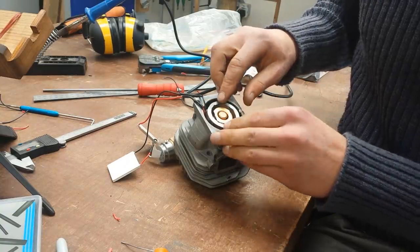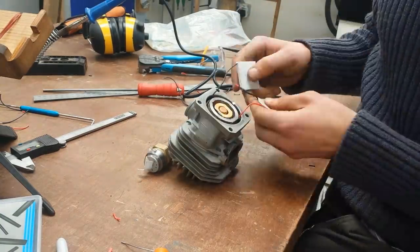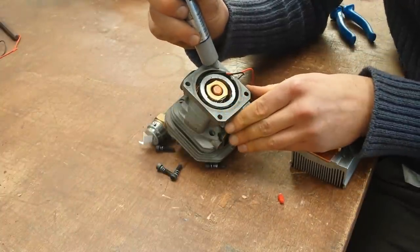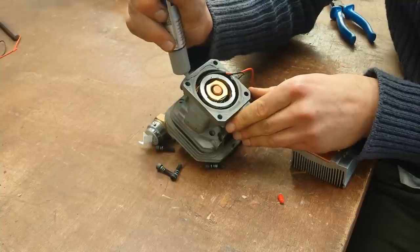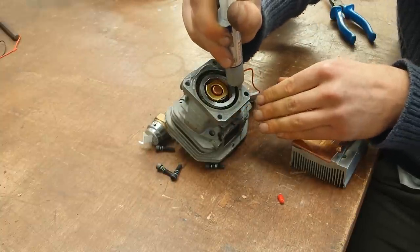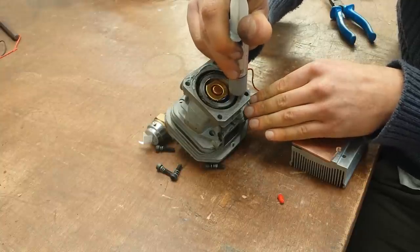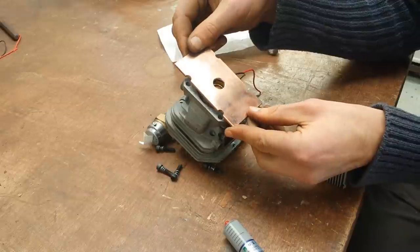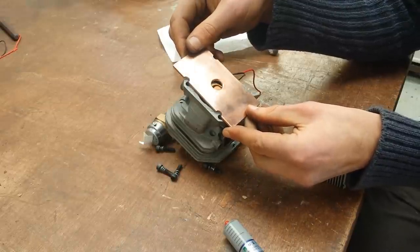This makes assembly a whole bit more messy, but don't forget the thermal compound around the cold side especially — that's between the cylinder and the copper, and the copper and the TEG. Those are the most important bits to really minimise thermal resistance.